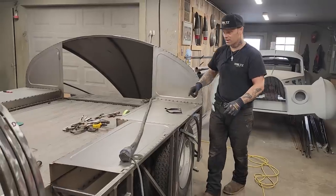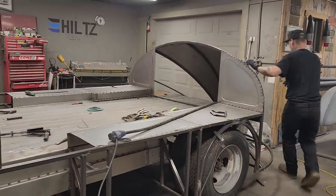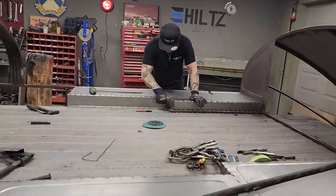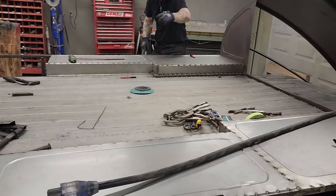And also what I did with the square stock, there's square stock running in here. I can't go across that cord, Jerry. I can go across there now. Let's go across there just to explain what's going on. I welded a piece of 3/4 square stock all the way along the floor, and I come out to this outside rail, made sure it was 92.5 from there to there.